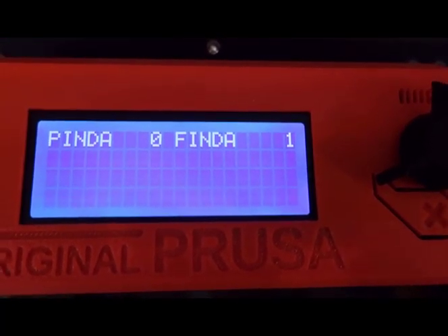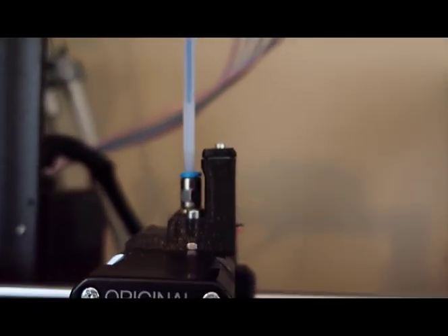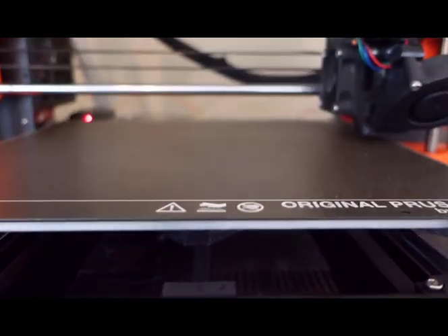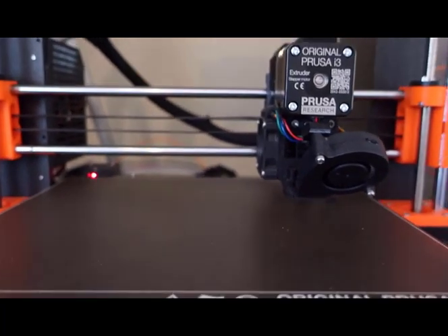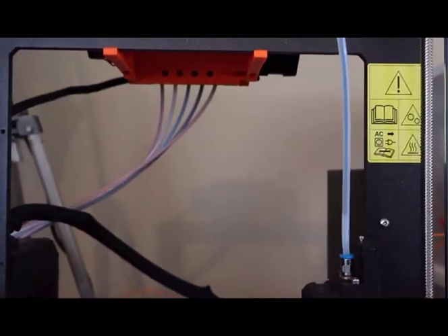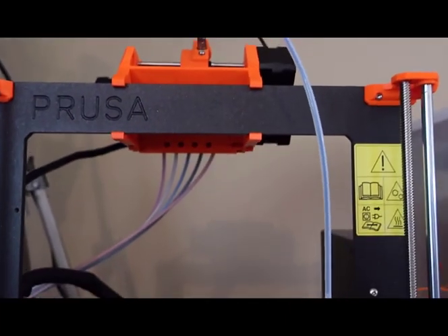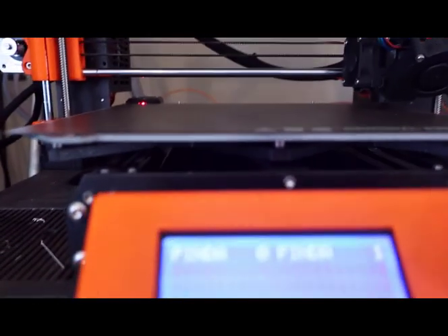MMU is loading filament. This is what my sensors are reading. The filament, if you can see it, stops short of the extruder head. We're not printing anything. This is also unusual, because usually the MMU doesn't even scan left to right to reset its zeros, its indexes. Usually it just stays there and ratchets.